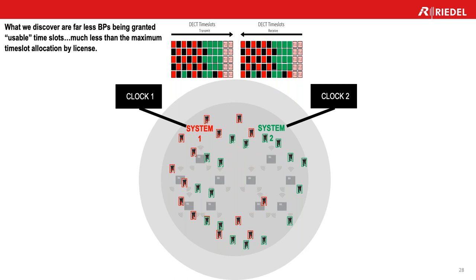Correct. They may have the same party line, but let's say, for example, limiting stage managers and A2s to the dressing room area, and nobody else can get on those antennas. Exactly. You don't want to overload a mission critical antenna that a stage manager is operating on just because five utilities are taking a smoke break nearby. Yep. There are ways to mitigate that. I think the best way, as we talked about, is to create antenna subsystems and let the belt packs, or don't let the belt packs, roam to adjacent systems.